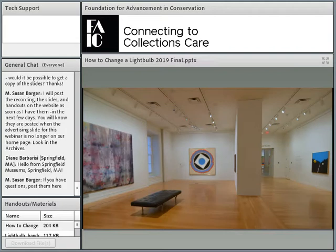We recently finished the gallery you're looking at with integral LEDs — the previous Maya Lin example was retrofit, this is integral. These lights have the capacity to change color across a whole range of options. When I got feedback from my curator, what she cared about most was the quantity of light — as much as possible right up to the conservation limit — and the distribution. She wanted no halos around the artwork, perfectly blended light. This ability to decide how tight or soft a beam is an aspect of distribution, and it was the most important thing when lighting this contemporary art gallery.